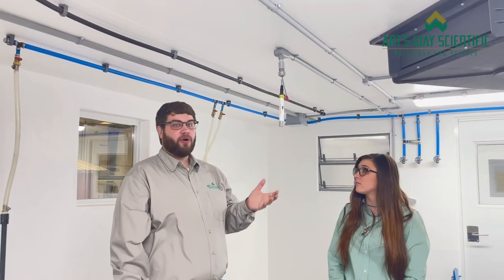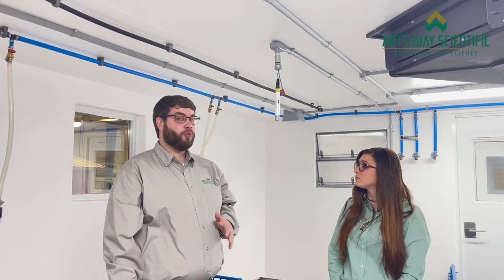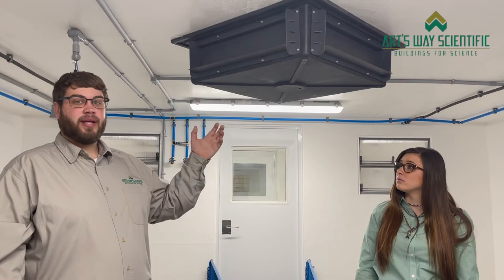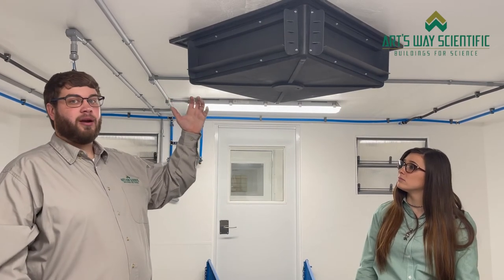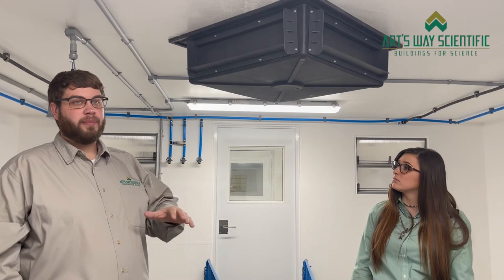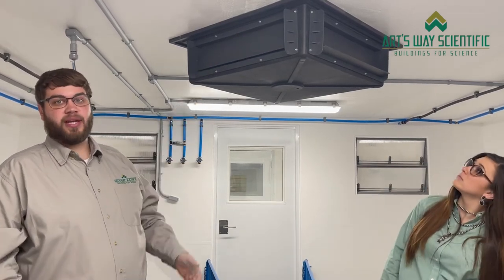In each room, we have our humidity and temperature probe. This is what our ECS controller uses to monitor and control the temperature in each room. The air moves from the attic down into the room through these inlets. This inlet has four sides to it, so it's going to move air into each corner. Our louvers are positioned to pinch air and move it further across so you don't have cold air dropping down on the pigs. During the summer, we can adjust our louvers to allow more air to drop down on the pigs to help them stay cool.